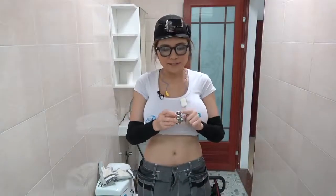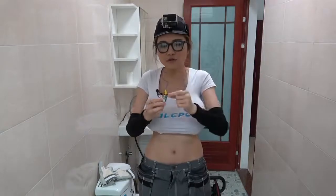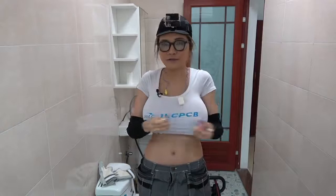I have this T-connector here. There are three holes — one inlet for the wall and two outlets: one for the toilet and the other one for the bum gun. It's very important that this rubber O-ring comes in the plastic bag. It's very important to put this on the hole first, otherwise it will leak. So make sure you get this if it doesn't come with the T-connector.